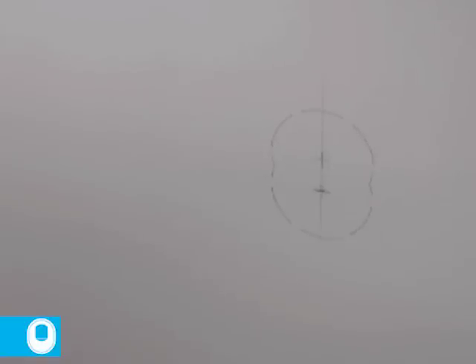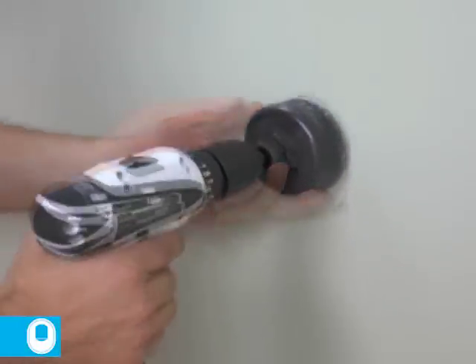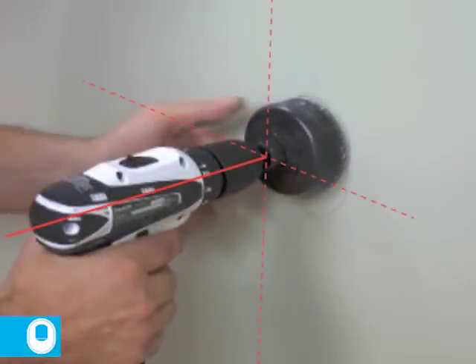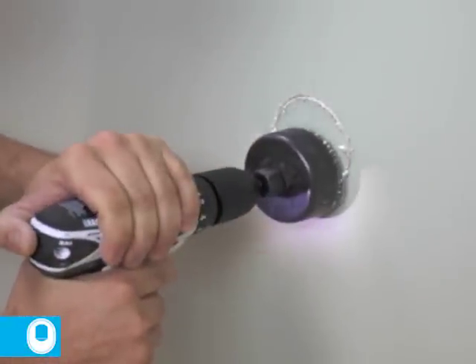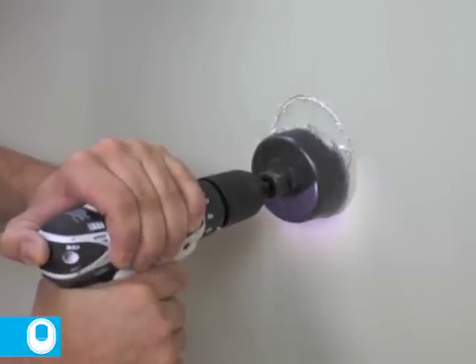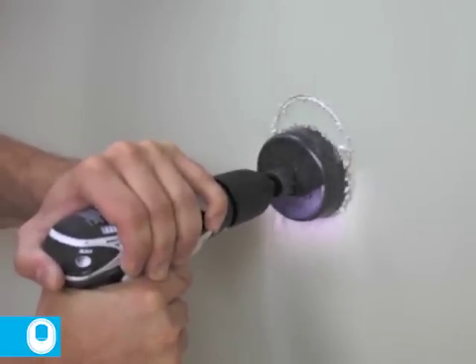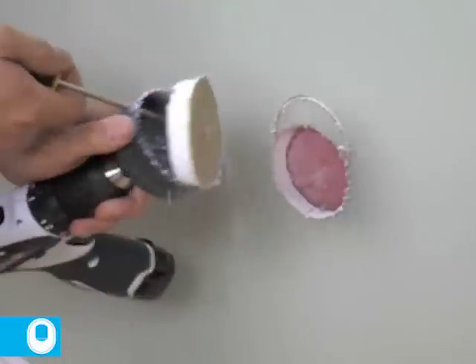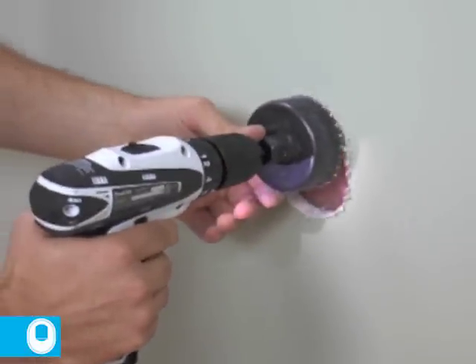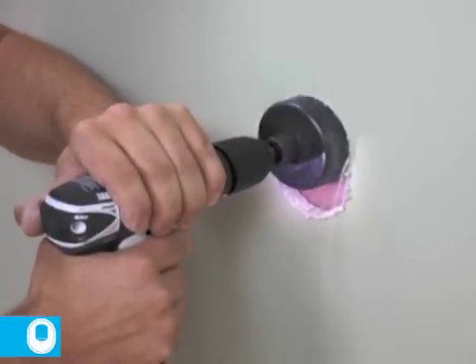Cutting the holes in the drywall is probably the most challenging part of the installation process. It is very important to follow these instructions exactly, otherwise you will not have a guide to complete the cut and you may have to finish cutting by hand. Start by aligning the pilot drill of the hole saw with one of the center marks. Make sure that the drill axis is perpendicular with the wall surface and that the saw teeth contact the drywall evenly. Don't drill too fast and don't push very hard. Cut only about one quarter of an inch into the drywall — do not cut all the way through. Move the pilot drill to the second center mark and drill slowly all the way through. Return to the first cut, drilling slowly and pushing lightly, and cut all the way through.